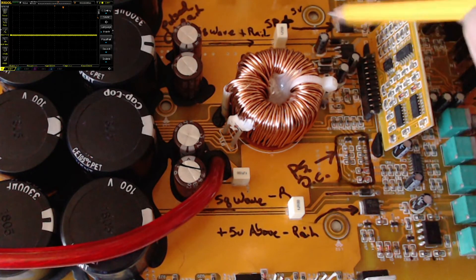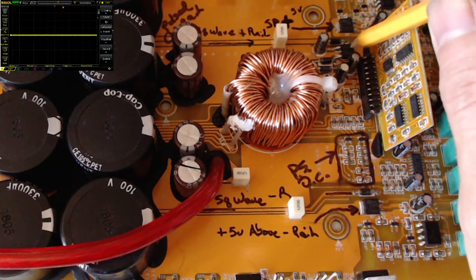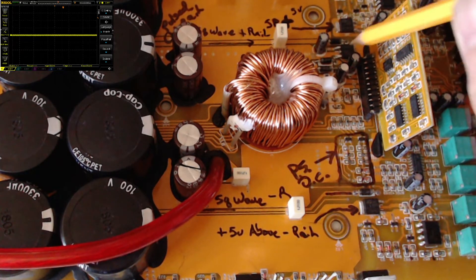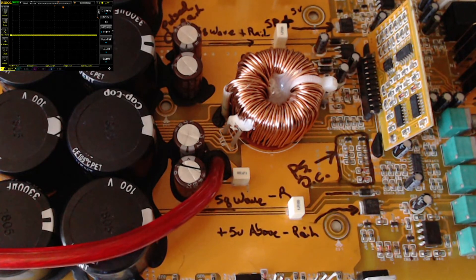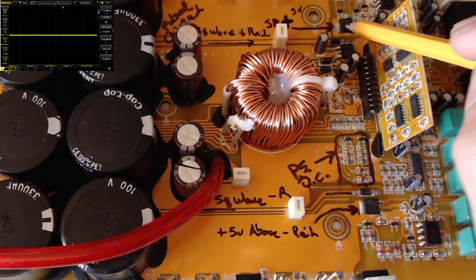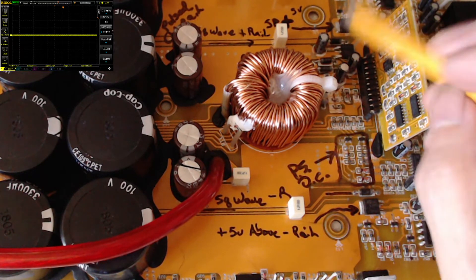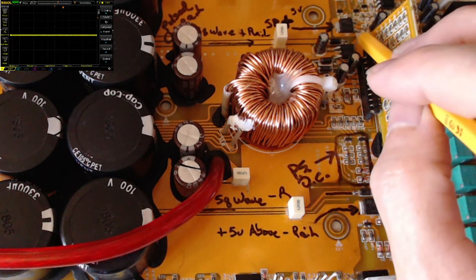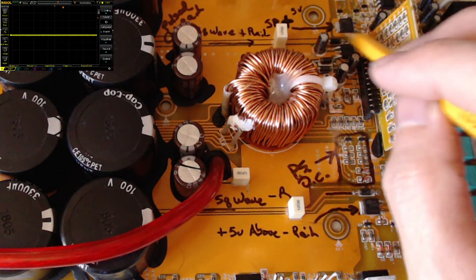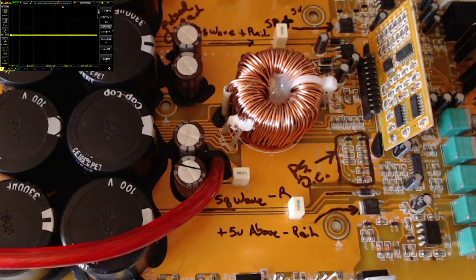This regulator is also referenced to these discrete diodes. You'll see a voltage drop, so you're going to get 11.7 volts into the input of this regulator, which gives you a 5-volt output from this regulator to pin 9 of your drive card - positive 5 volts to pin 9. This regulator is referenced to the positive speaker terminal, where you'll see full rail-to-rail switching on the input of the regulator, but referenced to your speaker positive terminal you're going to get 5 volts.